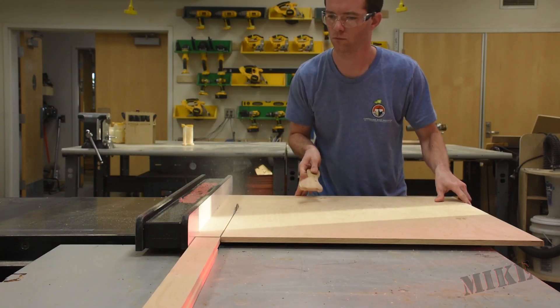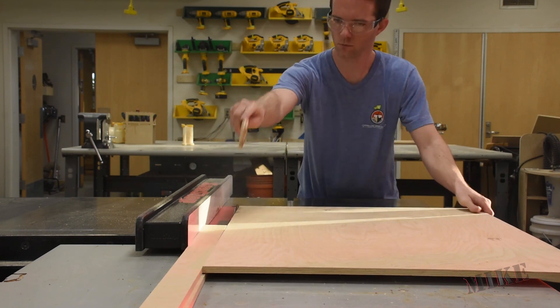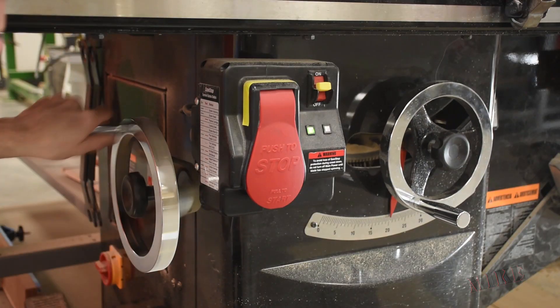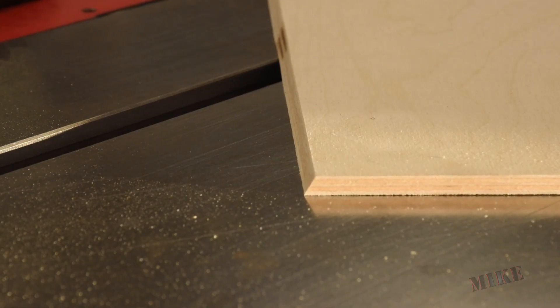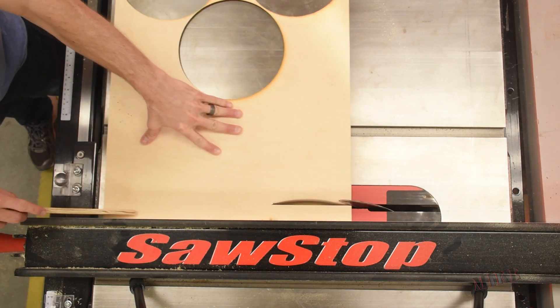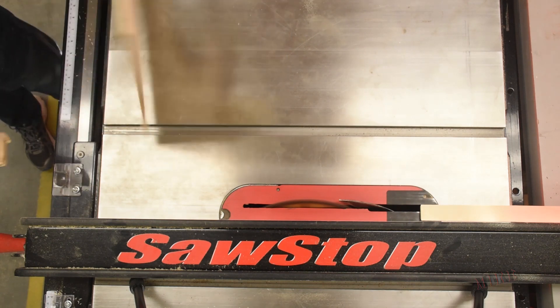The cope and drag will only be three inches deep and I'm ripping them out of half-inch plywood. I'm going to put some tapered grippers on the inside so that the mold should stay together better when it's lifted. These are only one inch wide and tapered at 30 degrees. Here's my starting cut — cut, clip, repeat.